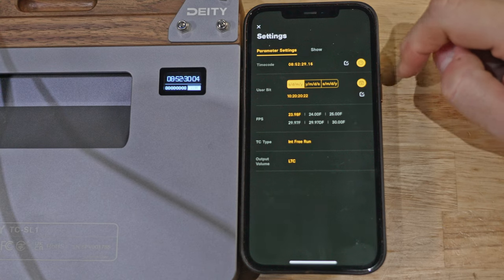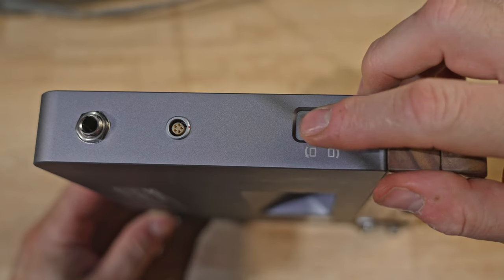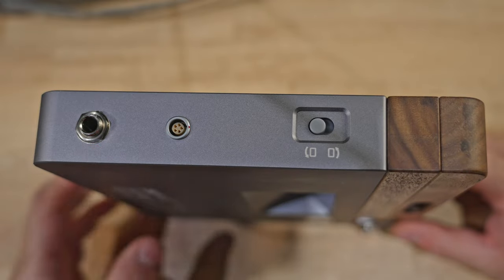The red dot matrix display is very clear on camera in all lighting situations, possibly even on the surface of Mercury. That dot matrix display can show not only timecode, but other messages you need to convey as well — frame rate, user bit, up to three independent customizable messages and special characters, all on a clap. On the side there's a little switch so you can allow clapping upside down. There's a power switch behind a little door, and a five-pin Lemo connection to send timecode to another brand of timecode device or have the slate read timecode from another device. There's also a quarter-inch TRS jack for sending timecode out as well.